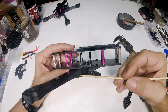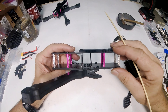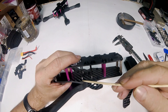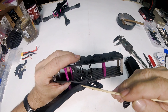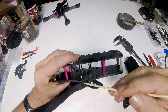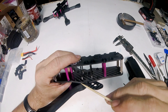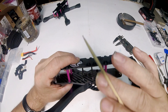By doubling the arms, you don't have to remove the stack screw anymore. When you take these two bolts right here out, there's a hole cut in this arm and the head of the bolt fits down into that hole so you can't pull this arm out directly. But what you can do is pull the bottom arm out, and then the top arm will just fall down and slide out too. So if you ever need to replace the arms, you slide one arm in, push it up against the plate, then slide the other arm in — you never have to remove the stack screws. That makes it sweet.